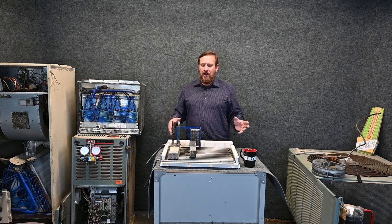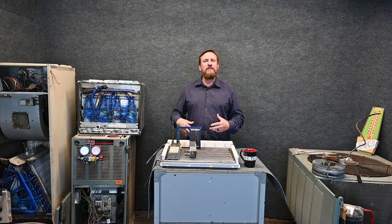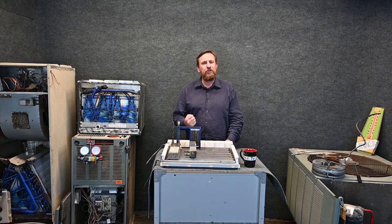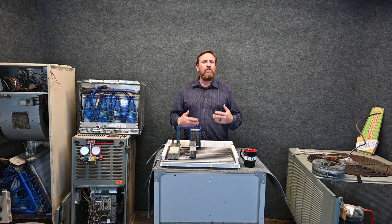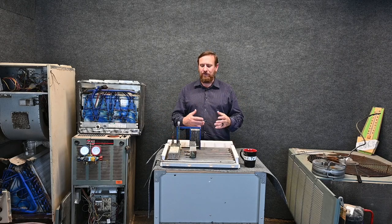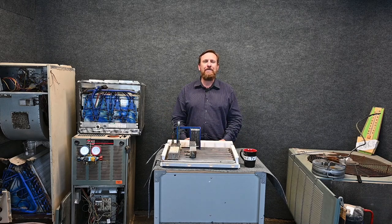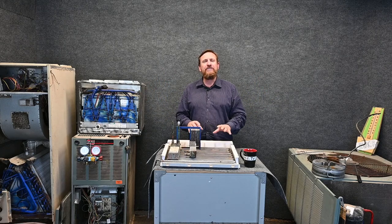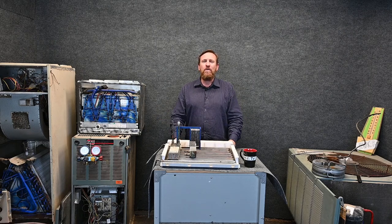I'm not wanting you to understand and memorize or learn all of these components. What I really want at this point in the course is for you to think about the bigger picture, about that refrigerant boiling from a liquid to vapor is simply absorbing heat. We can absorb heat from many different things, such as ice cream or beer or water or fluid or soft drinks or the air or ice or anything else. So if you're thinking about that movement of heat, or think about those thermodynamics, that's what's gonna get you to that next level, that bigger picture. So we don't need to worry about all these little details just yet, but ideally it's inspiring you to think about all other things that we can do with refrigeration, with that refrigerant changing state from a liquid to vapor.